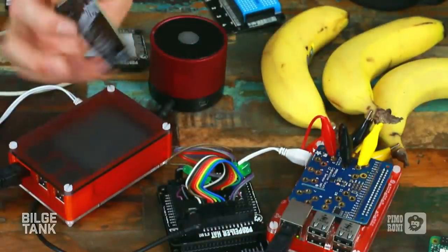It is a nice chip. I think it was a company who were bought by Microchip who developed this. I don't think it was Microchip in-house. It's a slightly weird chip to work with. It's got some nasty stuff. I think we basically talked to it via I2C, but it has extra lines for locking whether you're allowed to start doing transfers. It has a master clear line. So it's kind of like I2C plus some stuff and pretty ugly at the same time.